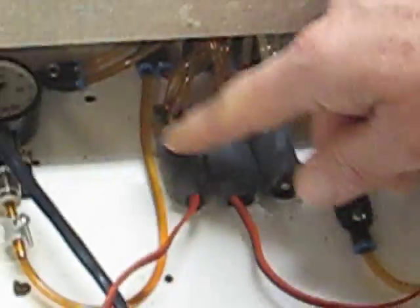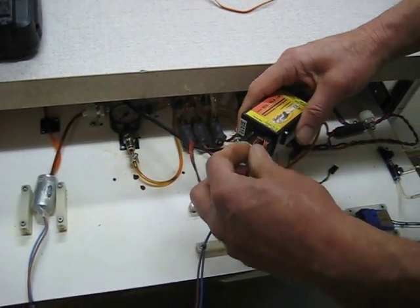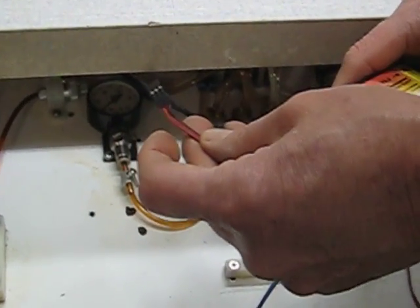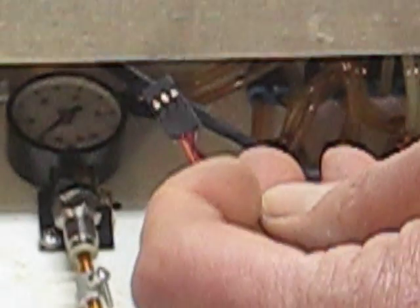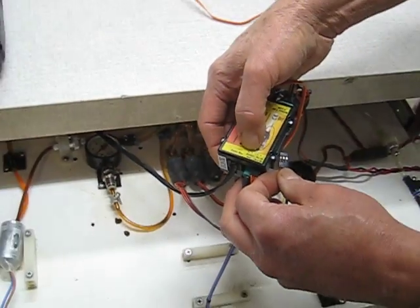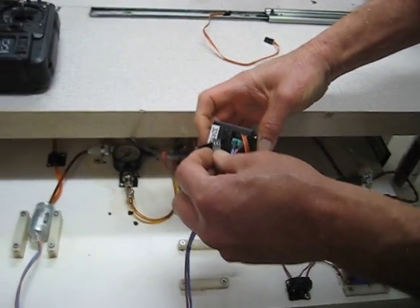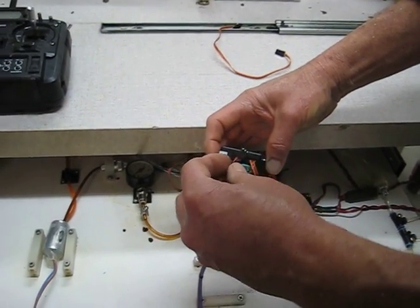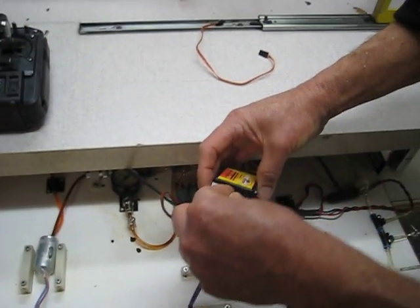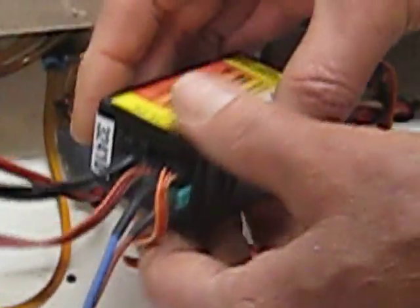You'll also have a fuel solenoid in the kit — a little smaller but essentially the same. It has the same three-color connector: orange, red, brown. Orange is the signal. You have the square wave for signal, plus, and minus. It plugs into the bottom set of three pins — the middle set closest to the fuel connector — not the top three, but the bottom three.